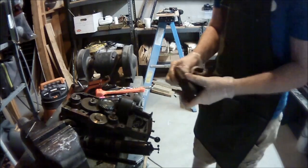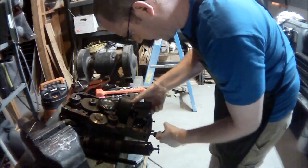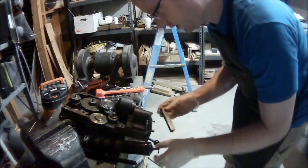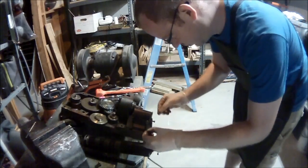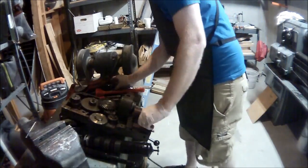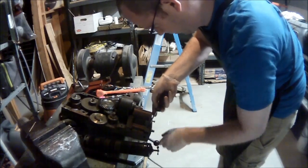There's a top and a bottom — the top has an angle piece to it. You can kind of see it in the top part of the picture. That slides underneath the other tube and then sits in place. The other one just slides into the keyway and then there is a piece of metal that applies a sideward force, which actually has two screws. I put a little bit of grease on that as well. I spent a bit of time trying to decide between grease and oil on several of these pieces — most of the time I went for grease just because it wouldn't be susceptible to capturing little shavings. I tighten this piece up with two flat blade screws, which are pretty interesting to still see — and no problem, everything is good.